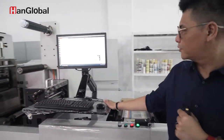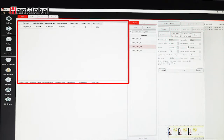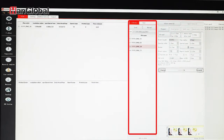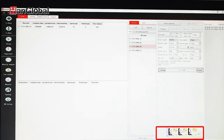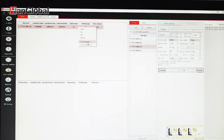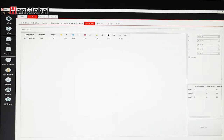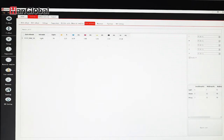This is our control panel — everything is controlled from here. On the left-hand side you can see the actual print file. In the middle section you can see the lineup of the file. On the left-hand section of the print you can see the repeat. You can see how many pages you want to print — here we have 19 prints marked. On the next page you can see all consumables and ink cost per repeat. For 19 repeats, the total consumption is 21.38 milliliters of ink.